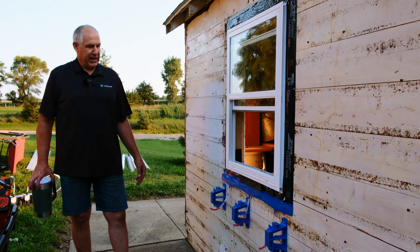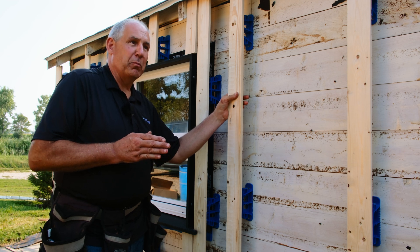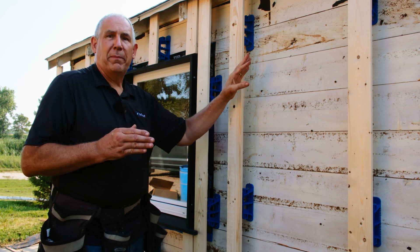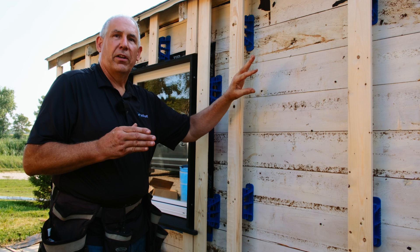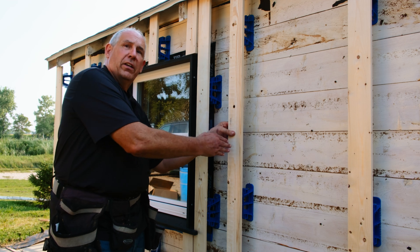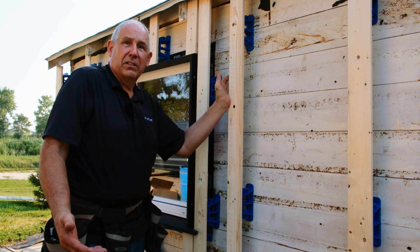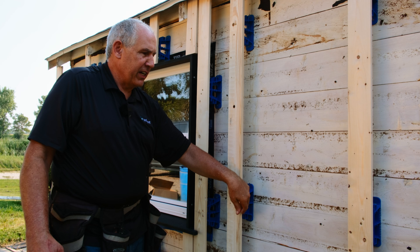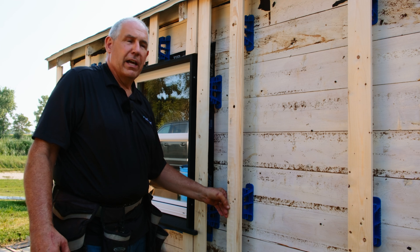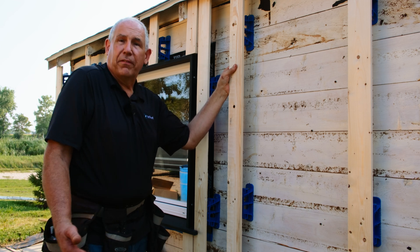One of the things with exterior continuous insulation that's always been difficult for a contractor is having the framing contractor do the foam insulation or rock wool insulation, then put furring strips on and try to run long structural screws through to hit the stud behind there. With the Insofast system, all of that is eliminated. There's no thermal bridging at all from the screws, and you don't have to recess the heads for the big structural screws. It just streamlines things and allows you to do a deep energy retrofit or a passive house on a budget.